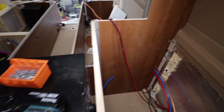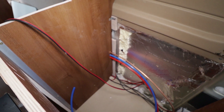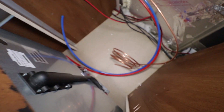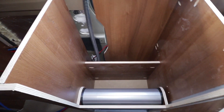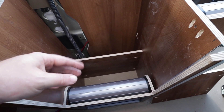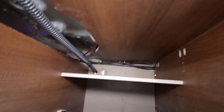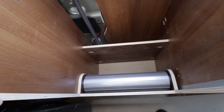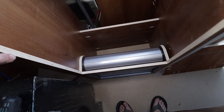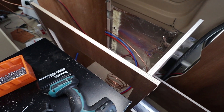Just thought I'd show you the way I run the pipes. You can see the hot and cold are coming through there, and above that is a gas pipe — that's going to be labelled of course. You'll probably see the coil there — that'll sit behind the oven, which is here. It's to enable you to move the oven forward, tighten all the bolts up on the gas, and push it back. It acts like a sort of a spring. Down the bottom is, hopefully you can see that, a drop-out valve, and beside that is the waste for the sink. On top the shelf goes, and that's the base of the oven and the top of the shelf. After that the fridge goes back in — hopefully this kitchen is done.